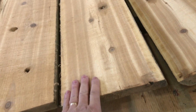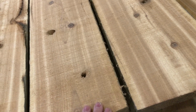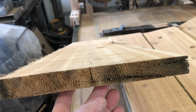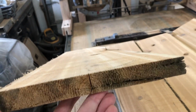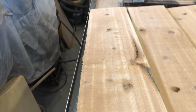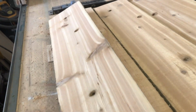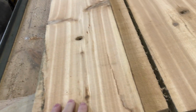And then I've got a couple really nice, very wide 5/4 boards, and out of the pith, fundamentally everything you see on the right side of the pith, that'll probably just be scrapped because there's cracks through it. But on the left side, we'll probably get about a 3.5 by 1 inch piece of lumber out of there, and that will be beautifully straight grained. And apart from this blemish here, it's a nice piece of wood.